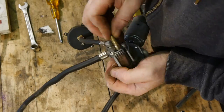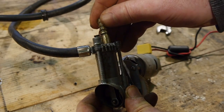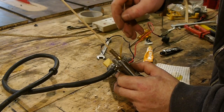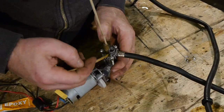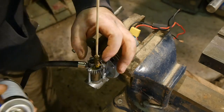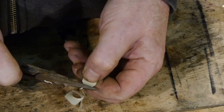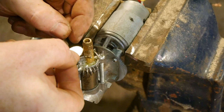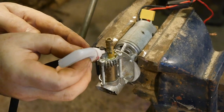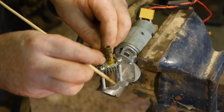In order for it to fit I just need to file it down a bit. Once I have it shaped to size I mix up a bit of epoxy and set it in place. I use a long wooden skewer to plug the hole so that if any epoxy seeps through it won't seal the hole that we're going to be sucking the air through. To help the piece stay in place while the epoxy is setting I use a little dab of CA glue and some activator just to keep it steady. On top of the pump there was a pressure gauge where the air was coming out. We don't need this anymore so I cut a small piece of metal from a bottle lid to hold the spring that keeps the valve in place, using CA glue initially then epoxy to make sure it's got a proper hold.